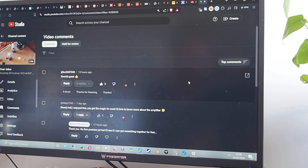It's shown me that my bottleneck is not even my flawed speaker. You can improve on the amp even despite flaws in the speaker. I always thought about this chicken-and-egg thing: do you need a good speaker to develop a good amp, or vice versa? I think you just need a speaker without real flaws, and then you can confuse yourself about where a problem comes from — for example, some tubes I was driving too hard, and you get harshness that a compression driver will mercilessly reveal.